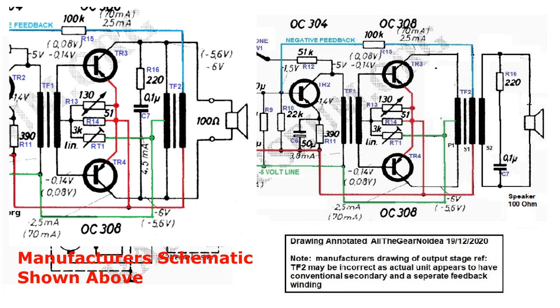It's to do with the topology of using PNP transistors rather than NPN, which I'm more familiar with. Back in the day they used PNP transistors because they were the first transistors available — NPN didn't come on the scene until a little bit later and were probably more expensive. So everything was PNP, and if you're working on PNP equipment you have to become familiar with the use of a positive earth line. As it turns out, our actual speaker is connected to the output of the secondary of our transformer and is not being directly driven from the PNP transistors as shown in the manufacturer's drawing.